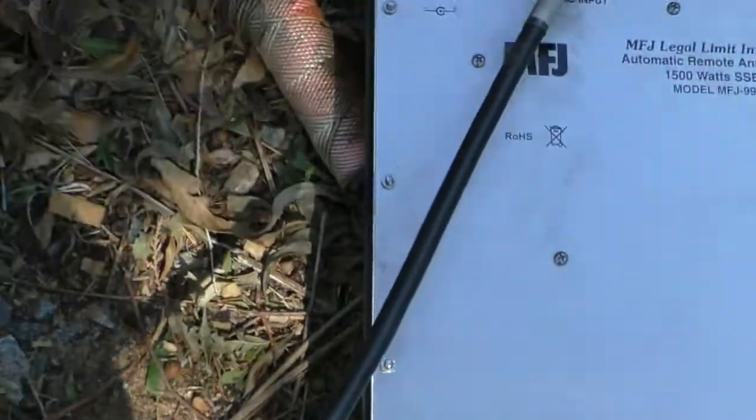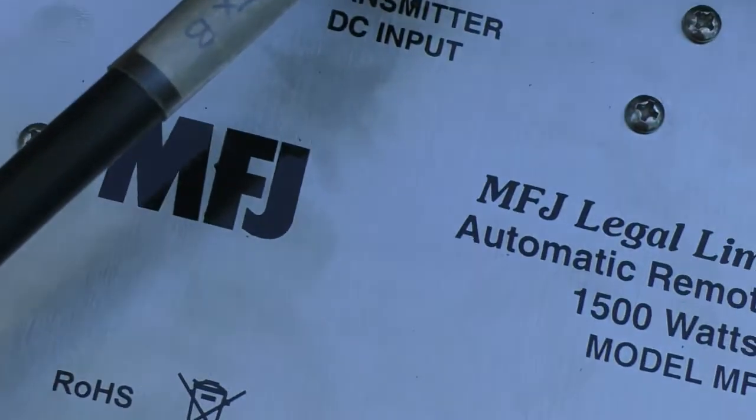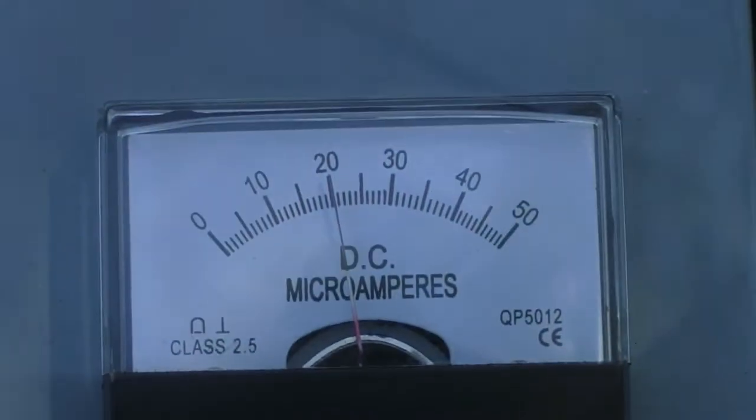It's a very short tail. All I'll do is take the coax out of the bias tee, because there's no bias tee required for this autotuner — it's got a bias tee built in. Transmitter and DC input — so that will just connect straight to the coax. I'll put 20 watts into it, get it to auto tune, and see if I get the same relative antenna current as with the SGC230, or whether it's better or worse.